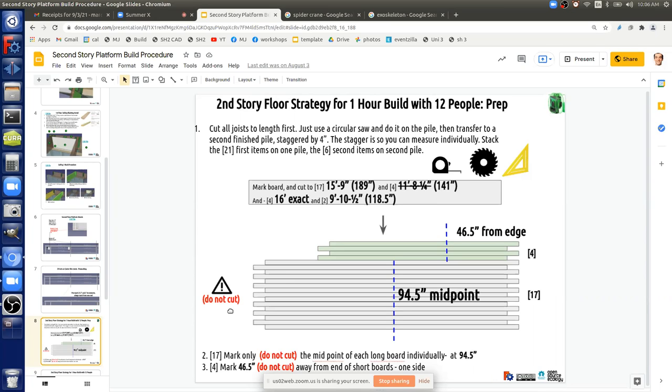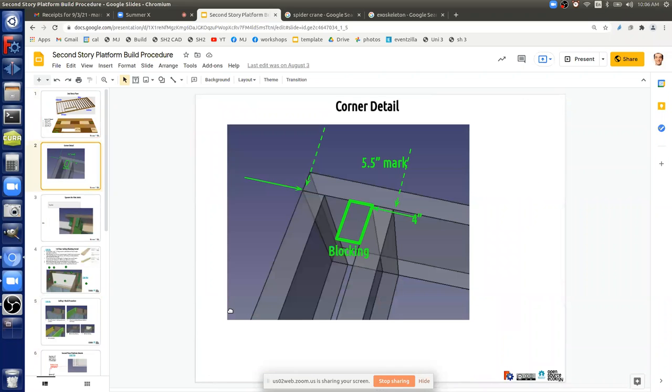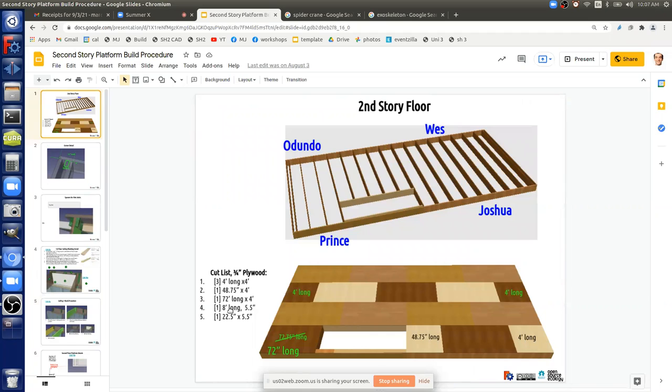So we did. And here, what I said, those lines there, we actually marked it down the very middle so that when we lay the plywood, we would lay the second row of plywood first, which means this row here, since that's going right down the middle. If that line is exactly down the middle, you know that this is straight and you can work around it, as opposed to working in a corner, which serves as a ruler for this side, but there's nothing on the other side. Starting with this one allows you to use that as a ruler for this row and that row as well. That's why we wanted to start on the second row there.